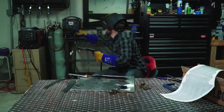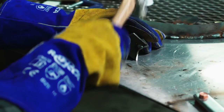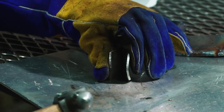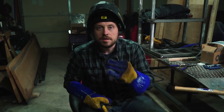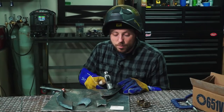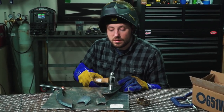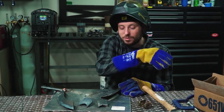Oh my goodness. You know what they say — the bigger the hammer, the easier it is to fix. It was warping out of place a little bit from the heat. I should have tacked both sides but I didn't because I'm lazy. Bounced back into place with the hammer — now she's lined up again.